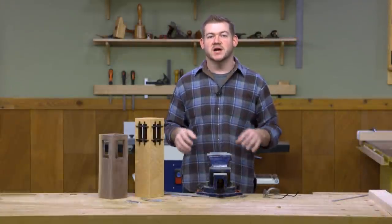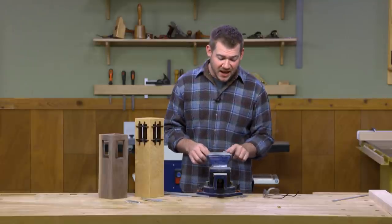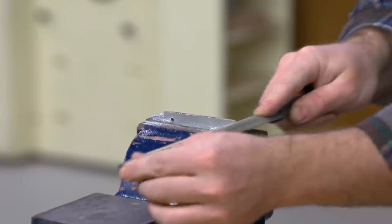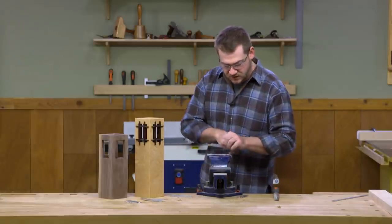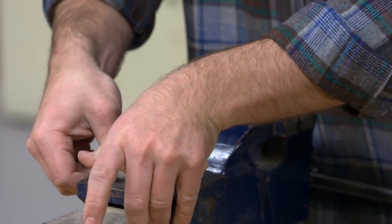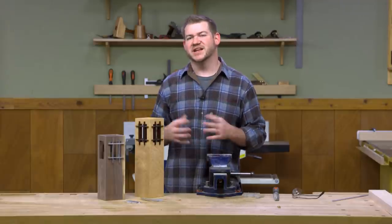The metal cutting blade does a really good job on aluminum, but it does leave some ridges and burrs. Be careful when handling them because those burrs can be sharp, and we'll need to knock those ridges away. To do that, just clamp it in a vise and use a normal file — make a couple of passes, and since the aluminum is soft it cuts cleanly and easily, leaving a pretty smooth surface. Once you have a set of these done they simply snap together, then it's a simple matter of sticking them in the window. I'm going to wait to glue these in place with five-minute epoxy until after I've applied the finish — it will just be cleaner that way.